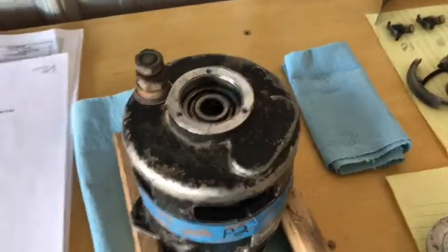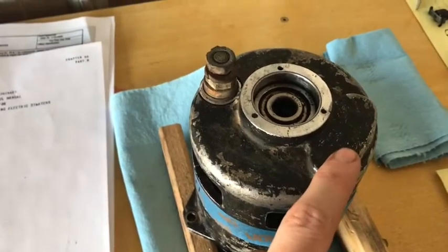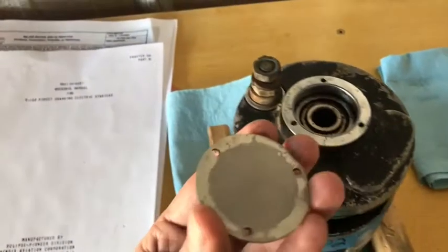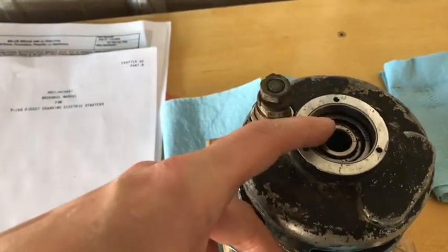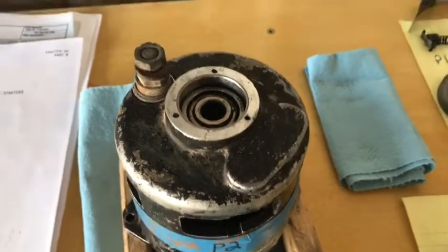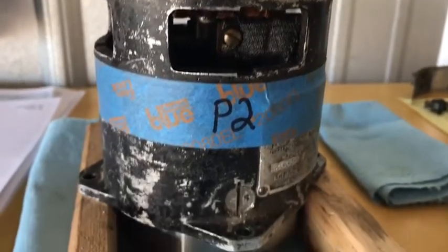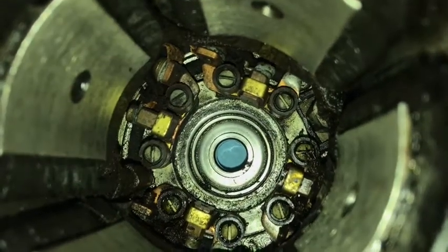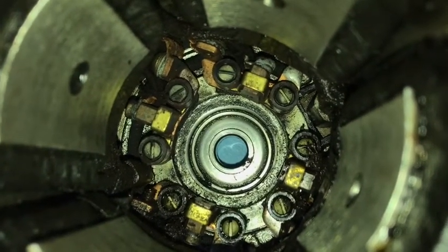On the rear of the motor housing on the starter is a single stud. The motor has dual studs. On the rear here is a small plate that covers the bearing on the rear. In there you find a washer and a nut on the rear end of the rotor. You can see where the brushes are located inside the cover. Inside the rotor housing you can see the brushes. There are normally springs that hold those in.